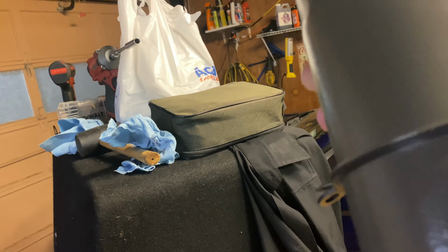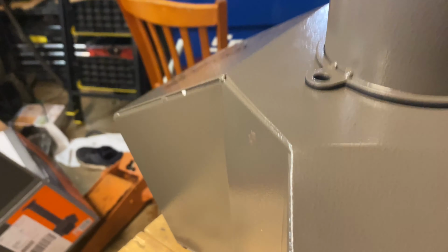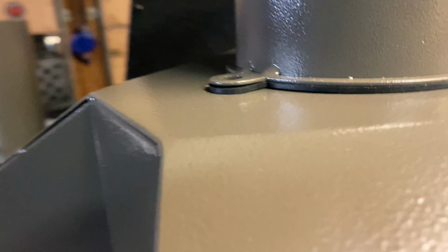this gasket here. You really gotta make sure it's upwards all the way around, so that when you install this, it doesn't leak or get water inside there. It's real critical that you make sure those seals are upwards. You see how it's upwards like that? It's perfect. You just want to make sure it's like that all the way around. And once you're good, you're good.